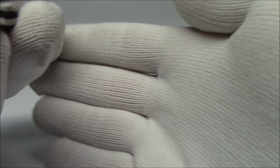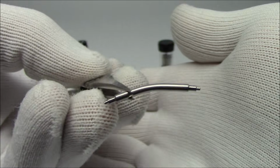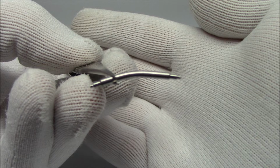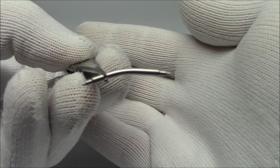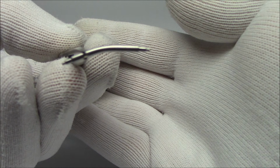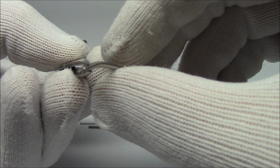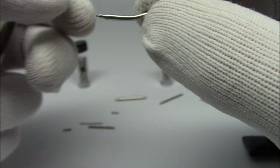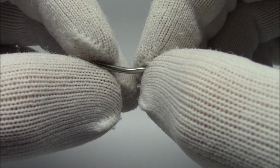And then, of course, there's spring bars for curved end watch straps. Now, there's nothing really special about this. You can buy them curved, obviously, but you can make it yourself. If you need one curved, just take a spring bar and press it against a can of soup or something a little bit. Or you can even use 2 pairs of pliers carefully. You just don't want to kink the metal. And this is obviously bent over a mandrel or something. Other than that, a curved spring bar is really just a straight spring bar that's been bent under control.